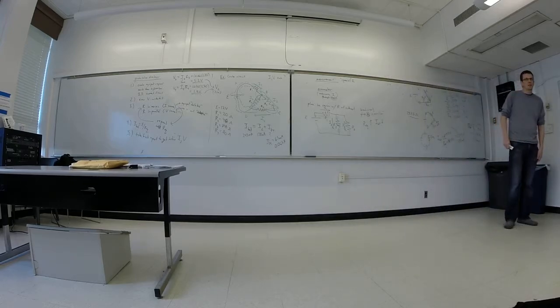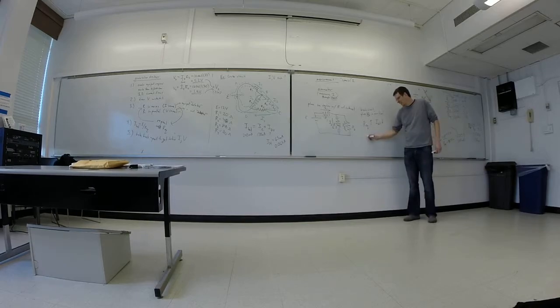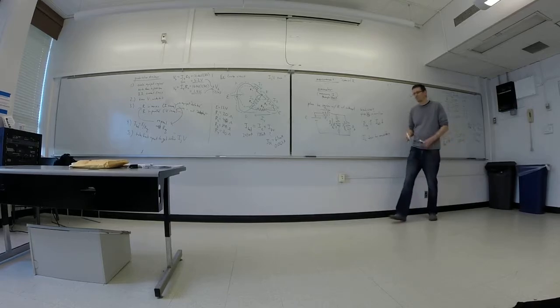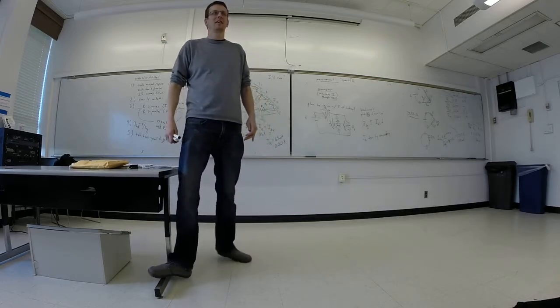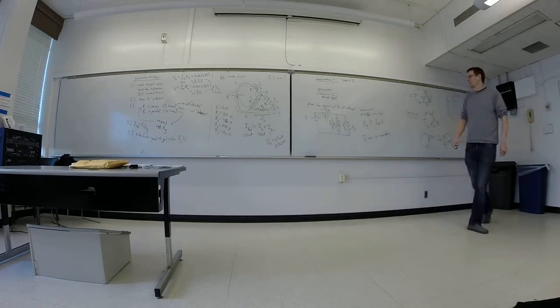So there's a cost of knowing. The cost of knowing is actually to decrease the very thing you're measuring. Okay? So the cost of knowing is that the I2 is actually decreased by the measurement device. So the thing that's being reported when you put the measurement device in is not actually what was going on before you put it in. There's a cost to knowing.